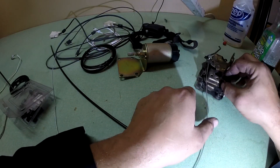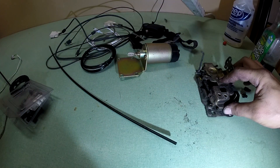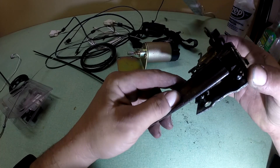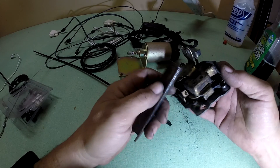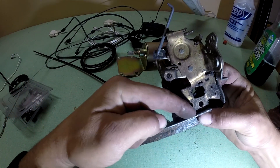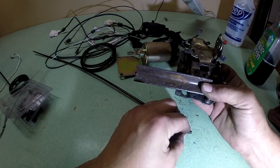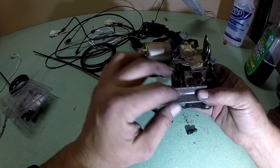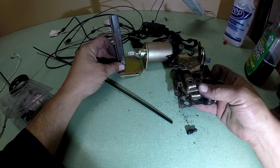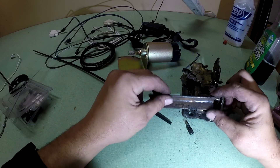So let me get started on this — I'm going to weld this one on here first. I think this is going to be the easiest modification I've ever done to anything. I've chosen a small piece of angle iron. This is going to fit pretty well right in here. The lighting sucks no matter what I do — I got LED everything and I just don't know. So I'm going to weld this along here, cut this about here, and put this little guy right in there. Let me get this all marked out — I'm going to cut this with an angle grinder with a cutoff wheel. I want to keep this simple and not overthink things.